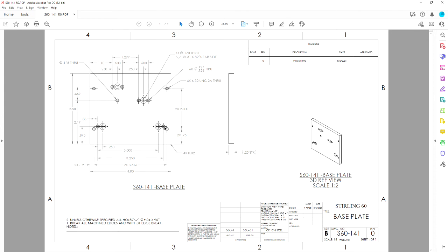Now we have another 1/8 inch hole, but it's a loose tolerance one. It's this one. It doesn't require reaming. So whatever drill bit we go through to cut these other ones before they're reamed can probably do this hole. We just omit the reaming operation for that single hole there. That hole is a wire passage for wires to go into an electrical box. So it's not critical on its diameter. But we don't want to spend excessive machining time making that a super precise hole either.